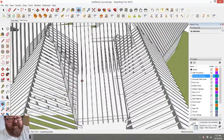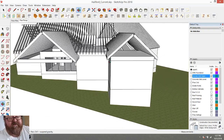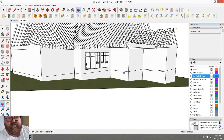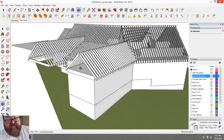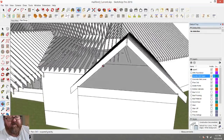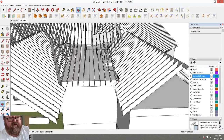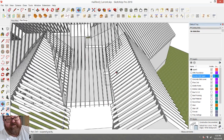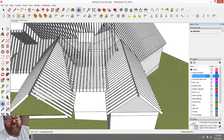I've seen that done before. Now this is getting a little interesting over here because we have these two gables coming out here. He wants a porch out here. I need to draw this grade on out. And then this roof is obviously gabled this way, so that leaves you with a little infill roof right here, so you'll have two valleys. And I'm getting ready to work on this one in just a minute. Actually, I'm working on this hip over here that's funky.